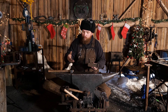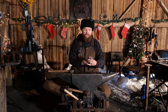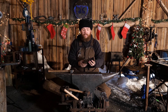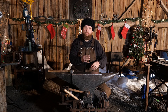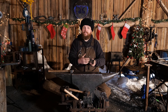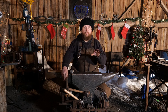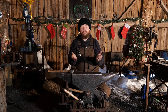I have some dies that have been in my shop for 10 years now. This is my own personal guillotine tool — these are mild steel dies — and I have used them day in, day out, almost daily for the last decade, and they are still holding up well. Yes, the top's all mushroomed off and I need to grind that up nice and clean. But this die is just mild steel and it's been in my shop for 10 years in a professional blacksmith shop, so it's going to get a lot more use than the home hobbyist.